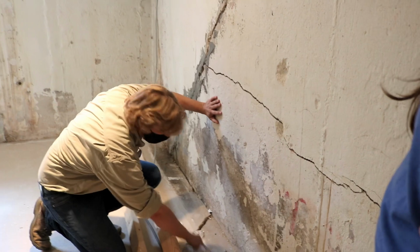That same horizontal crack, you can also see it in the basement. You can look at the wall, and if there's a big horizontal crack where at the ends it goes down towards the corners, that wall has some inward movement that caused a crack. Let's say most of that wall is finished, and you've got a sump pump on one side and a utility room on the other, and you can at least see the last few feet of the wall. Well, if there are cracks at the bottom corners coming up towards the center of the wall on both corners, that's a sign you may have some wall movement. It'd be a good idea to take out some drywall to confirm this.